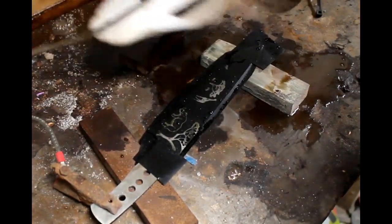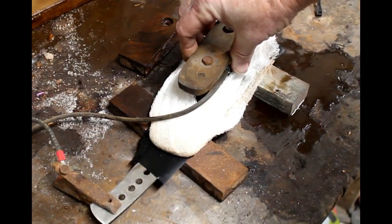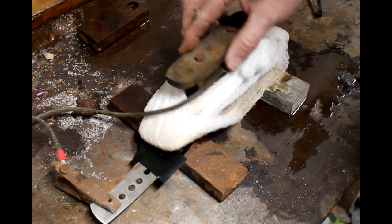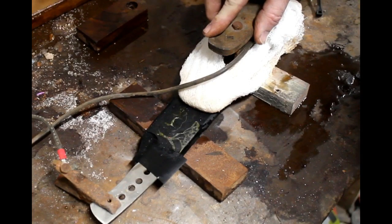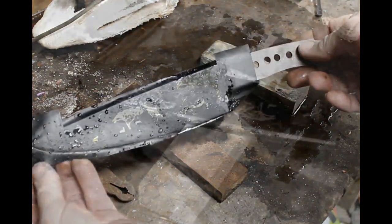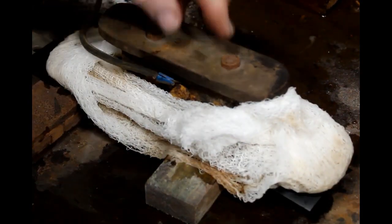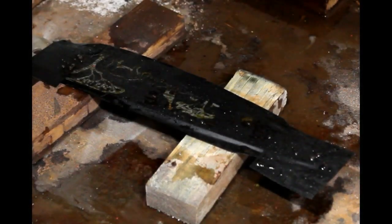I do that three or four times depending on how deep I want the etch to be — etching in 20 to 30-second increments for a minute, then cooling it. My fear is that I don't want to overheat that self-adhesive vinyl to the point where it loses its adhesion and etching solution goes underneath, which would absolutely ruin the blade. I've got the blade suspended on a couple pieces of wood so it's not sitting in fluid. Once that first layer is completely etched, I'll go back and etch it a little bit more to make sure it's deep enough, then remove number two — the next darker area in my design.